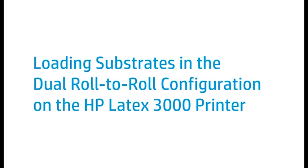This video shows how to load substrates in the dual roll-to-roll configuration on the HP Latex 3000 printer. Two substrate rolls are mounted on the rear dual roll spindle and are collected on the front dual roll spindle. This configuration is suitable for printing two entire rolls at the same time. The substrate cannot be cut mid-roll.